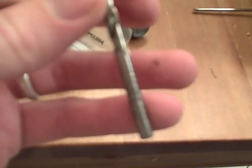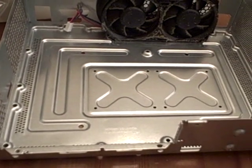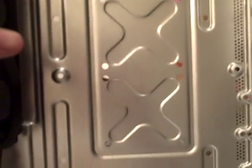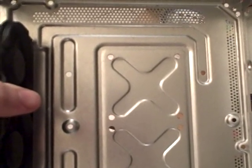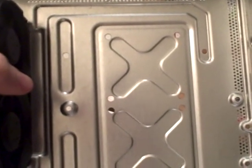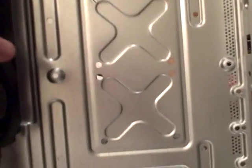My bit's a little warm where it's spun so I can't read the size, but I think it's 3/16ths. So I think this will be big enough. We'll drill those 8 holes out to 3/16ths and we'll see if that's big enough. Okay, the holes are drilled bigger. The 3/16ths was just a hair too small. Instead of stepping up to 13/64ths, I just wallowed it out just a little bit with the bit, and they fit perfect.